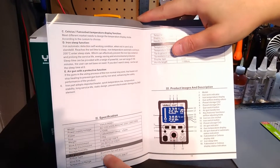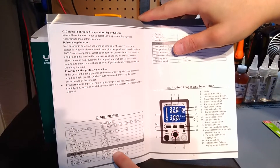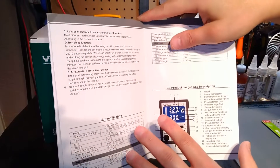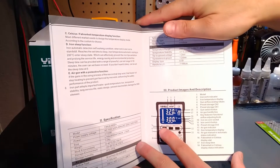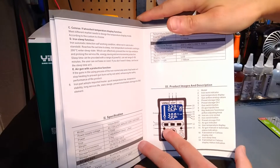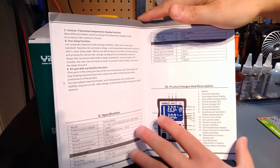The actual heat gun integrated in the soldering station utilizes a brushless fan. With 720 watts, these units heat up very, very quickly — I would say tops 25 to 30 seconds. I've checked the temperature on these units using my Fluke 179, and I can tell you that they're usually within a couple degrees. They're very, very well made and they hold temperature really, really well.